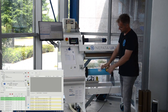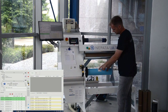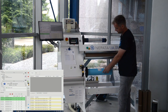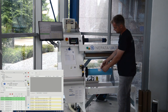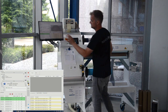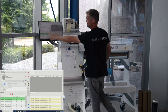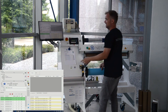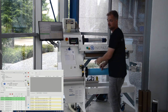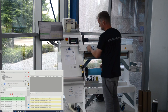The operator will scan the Convert Plus II label on this roll, which provides the product code, the name of the material, and the length remaining on this particular roll — all in text and also included in the QR code. When scanning this roll, the software stacks together all relevant jobs for this kind of material. In our case that's two different jobs: one of two meters length and one of five meters length, stacked together so you save time on loading and unloading the roll.